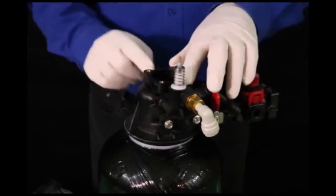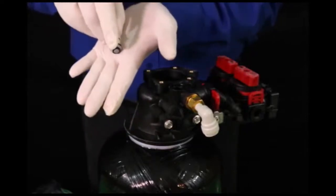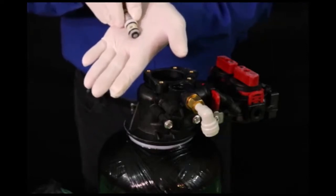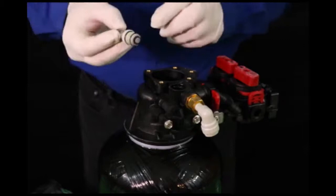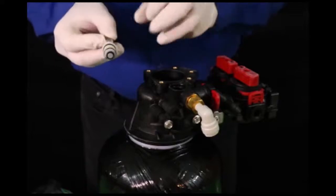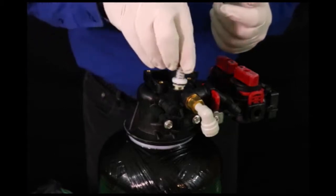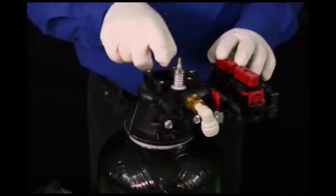This is the brine valve — it's on O-rings, you just pull it loose. There's a little poppet on here that needs to be in working order. That's what starts and stops the water flow from the brine tank. If that's damaged, you can be filling the brine tank when it's supposed to be turned off. So examine that — if it's in bad shape, just put a new one in. To put a new one in, make sure both O-rings are here. Take your silicone grease and just shine those up — never glob silicone, just shine them up. Get it shined up, set it back in place, firmly put your thumbs on both sides and push, and it'll pop right back into place.